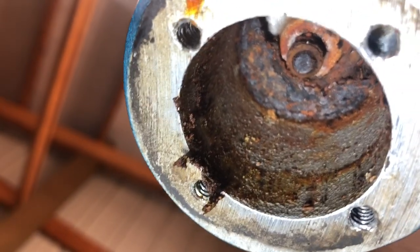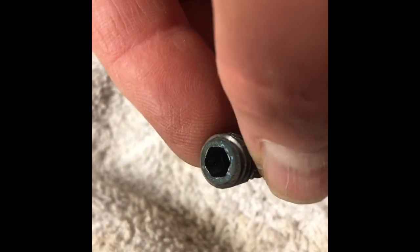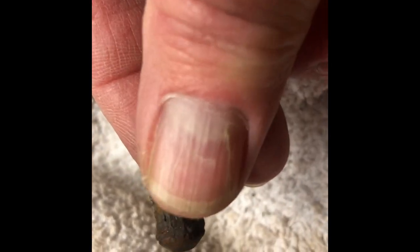I got my heat gun out, and I got that adjustment Allen out of there. The way I got it out was the reverse direction — basically instead of backing it out, I advanced it out the other side. Looking at how corroded this is, that corrosion is proud with the threads, which is why it would not come out through the hole in the proper direction.